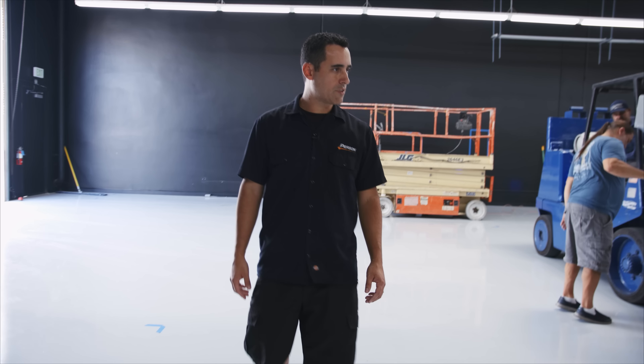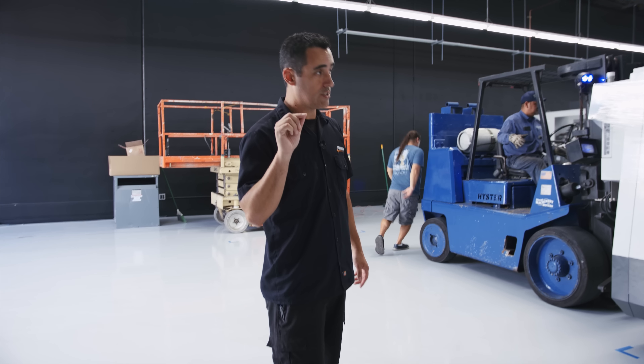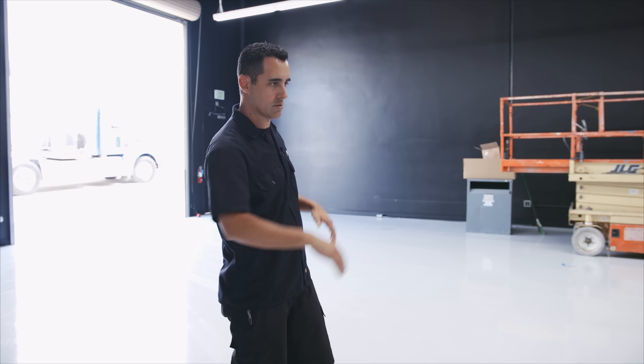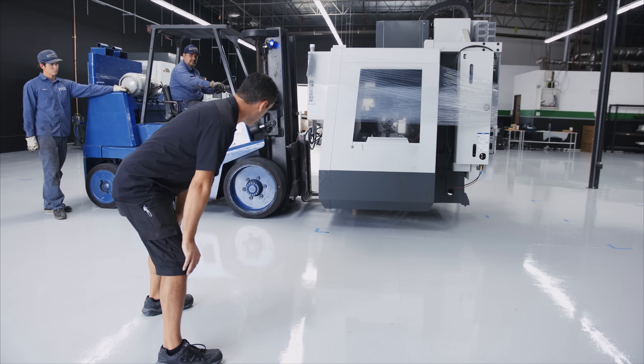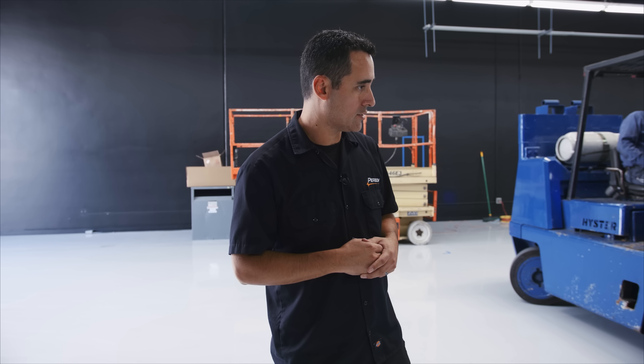We have all the fronts of the machines marked out with corner tapes. Corners of the machines should be right above the corner of targets. Close is good enough, but straight is really important. One of the things to remember is we're the customer. So if you're in the same position, don't feel pressured for your riggers to put your machine in a spot to make it easy for them. We will spend half an hour getting a machine straight in the right place if that's what it takes. These guys are pros — nail it the first time, good communication, everyone's happy.